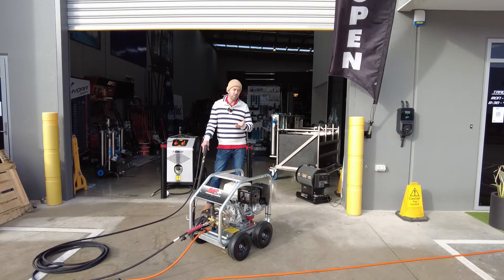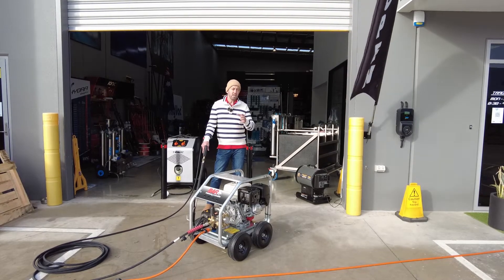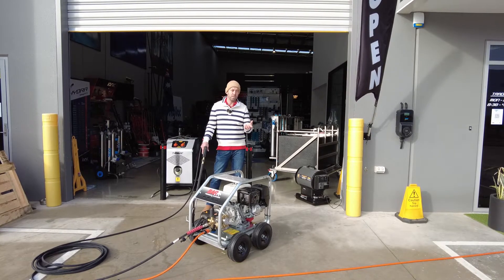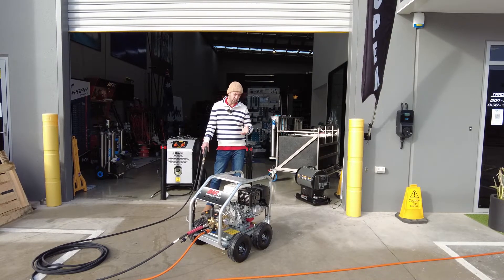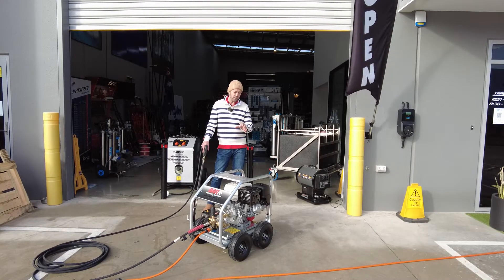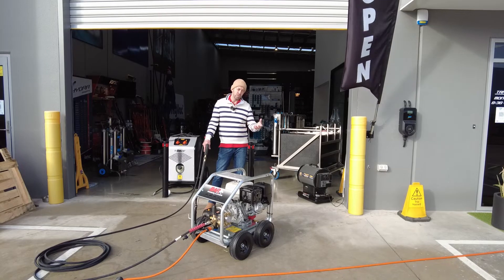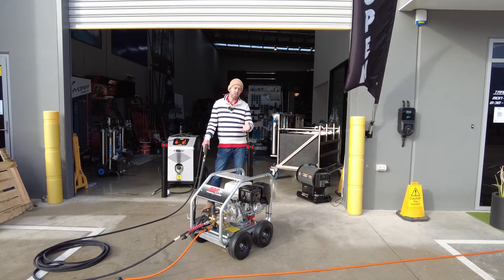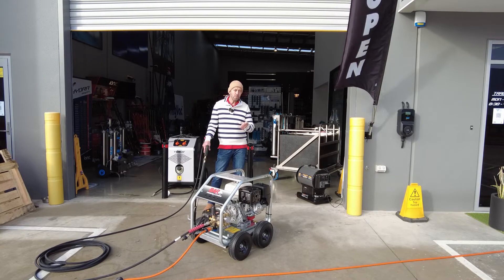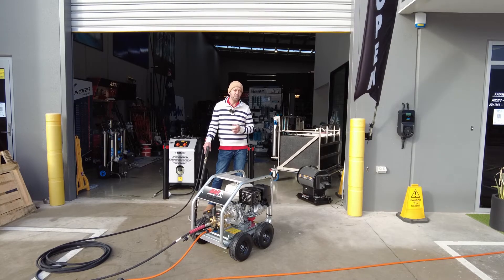So will this change the way you work within your business? All pressure cleaners have an unloader valve, and in my opinion the unloader valve and RPM shouldn't be touched. We need to adjust pressure when carrying out cleaning, and if I go on that philosophy, the only way you can change pressure without touching the RPM or the unloader valve is to increase your nozzle size. On previous predecessor engines — currently available on this model with the IGX as an optional upgrade — you would adjust the RPM to adjust flow, and adjusting flow adjusts pressure.